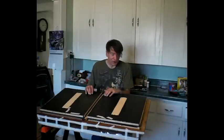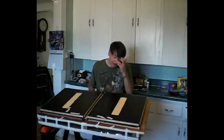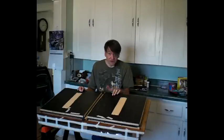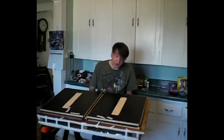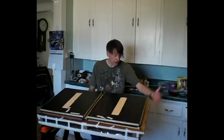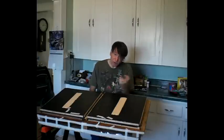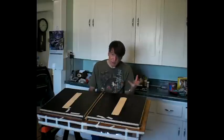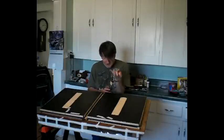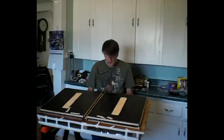I've never hit another set of bellows like this in my life that were so stubborn — the bellows cloth would not free itself. I tried everything. I took everybody's advice, even to the point of borrowing a butane torch from the neighbor next door and actually torching the side of the wood. The glue did loosen to a point. The rubber bubbled a little bit but didn't really drip off. But what happened is it charred the wood very badly — to a point where the wood was still red hot after 10 minutes, and yet barely could I get maybe a half inch to an inch free.